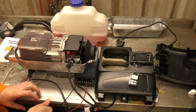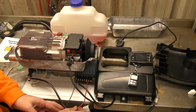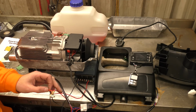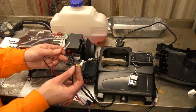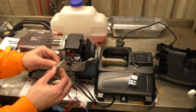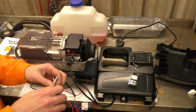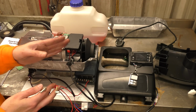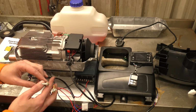Okay, a thought has occurred to me. Right, we're all in agreement that it's taking in 240 and it is absolutely giving out 24 volts. Now, rather than test the voltage at the glow plug, why don't I give the two terminals that we have here 12 volts? If I give them 12 volts and the heater turns on, that means that it's going to run on either 12 or 24, and that the heater ECU has a 12 volt regulator, which will take in 24 and give out 12 to power the circuits.